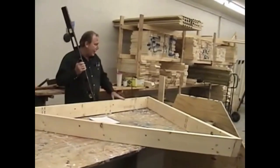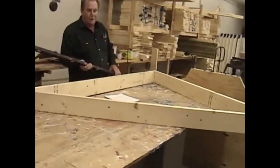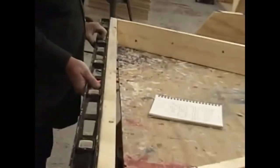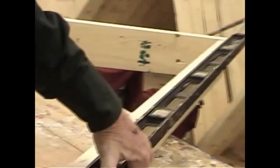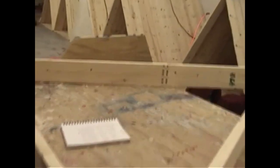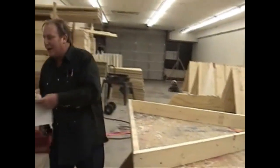And I'll check the framework to see how straight it is. I already know that the measurements — because everything's cut exactly — there's no variation. So this looks pretty good on this side. I'll check over this side. It looks pretty good there. And over here it's got a little bow to the inside like this. So once I check out the carcass and make sure it's reasonable, I can kind of get an idea of what I'm up against.